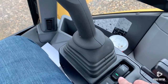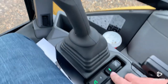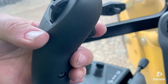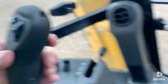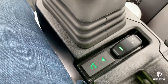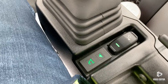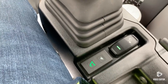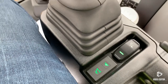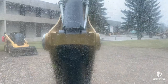As soon as we turn the switch on, you can see that the switch illuminates and turns green. Now dual mode is initiated — enabled. When we're in dual mode, on the back of the left hand joystick there's a trigger. When I press and hold that trigger, you can see that the front end loader indicator has lit up. When I let go of the trigger, the light goes out. As long as I hold that trigger and the green loader light is illuminated, I can run my loader using the right hand joystick while I'm still facing backwards.